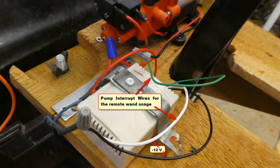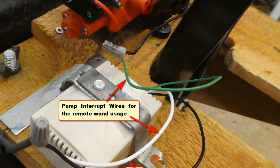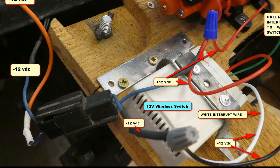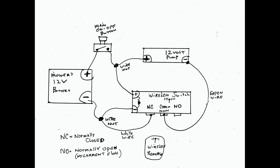Here's the negative wire going to the pump. I've connected a green wire to it and interrupted it — the green wire goes into the relay and will interrupt the power whenever I press the remote button. The remote is also connected directly to the 12-volt supply. Here's a diagram showing the wiring of the pump and the wireless switch component. With this arrangement, the wireless switch on the platform always has power to open or close the relay. Until the wireless remote is pressed, the circuit is normally closed, allowing the pump to run when the fender switch is pressed.